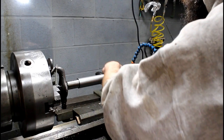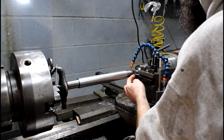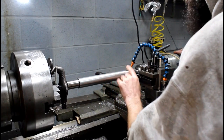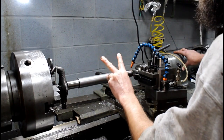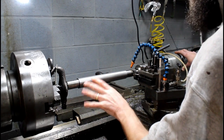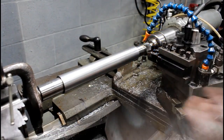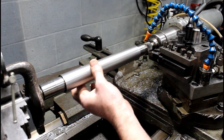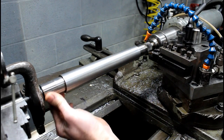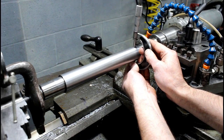I've tried several things. I've tried a shear tool, I've tried different geometry, carbide inserts, sharp high-speed steel, and this is about as good as I can get with a real positive cutting carbide insert. It's not bad. I mean, it's perfectly acceptable and should be fine, but I don't know. I'll probably end up making 2 of these shafts. This will probably be my practice piece, and then I'll probably buy a good piece of 4140 or something like that, maybe a piece of stress proof. I'm just not sure yet, but I have this on hand and I can start making something, so that's what I'm doing with this. Here's a little closer look at the finish. I don't know how much you can tell there, but this shafting is fairly hard, so it's tearing more than cutting really, and this was a ground shaft to begin with, but nonetheless I'm going to move forward with it because, like I said, I want the practice.